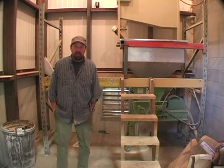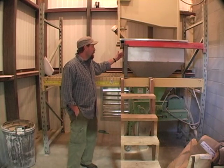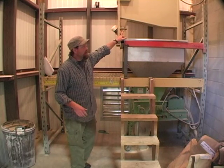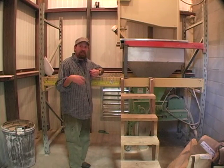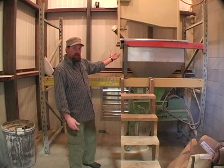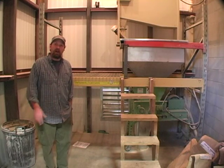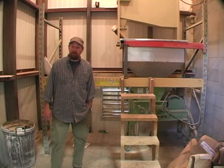This is the mill room — pretty simple technology. This is what's called a hopper or a grain bin, and underneath us is what's called a grist case. What we do is we take the whole kernel grain and bring it in. That unit up top is the scale — it basically weighs out each individual dose of grain so that we get a running total. It drops down into this hopper for a little accumulation of grain, gets milled right here, and then simply with gravity drops straight through the floor into an auger line that moves it over to the grist case. From there it'll drop down to the mash tun.